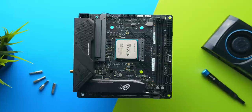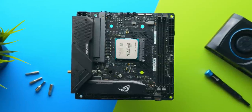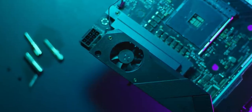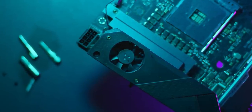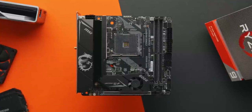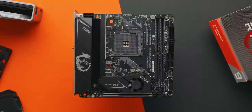Now let's take a look at the specific boards we'll be testing today. First up we have the ASUS B550i Strix, which borrows a lot in design from its more expensive X570i model. One of those features is the integrated VRM fan, which can be useful in cases with restricted motherboard airflow — it doesn't actually spin up until the VRM starts warming up. Next up we have the MSI B550i Edge Gaming, overall a great looking board on the surface, with a fairly reserved heatsink design but MSI do include a cooling plate at the rear directly behind the power stages.